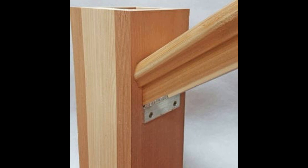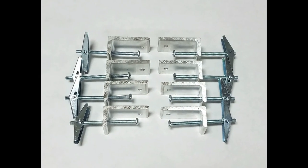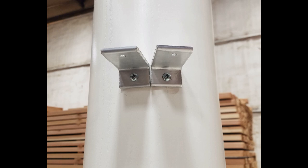One exception is with the bottom side of the stair rail brackets. The brackets at the bottom of the stairs will have the short leg of the bracket pointing down. We do this because if we make the bracket with the leg pointing up, the tight angle is too difficult to screw to the newel post. A quick note about attaching to round columns: if you're mounting the rail onto round columns, the preceding method won't work. We've developed a rail-to-column kit with modified brackets and a slightly different installation method. The rail-to-column hardware kit is an optional kit that has eight narrow brackets and toggle bolts. Your rail-to-column kit will have additional instructions, pictures, and tips included for this situation.